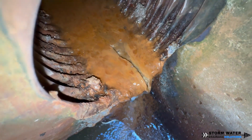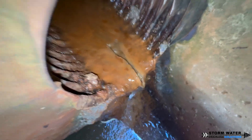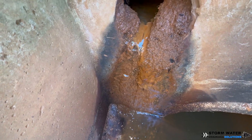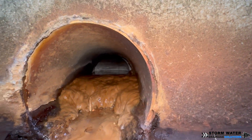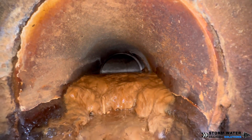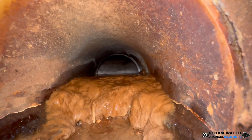So what exactly is iron ochre? Basically, iron ochre is a naturally occurring biological process. It's created when iron oxidizing bacteria that exists in the soil and in the groundwater consume soluble iron that is in the water. When this water is exposed to oxygen — when it enters a drainage system and there's more void for oxygen to travel through — the bacteria oxidize the iron into insoluble iron. What this does is it creates a slimy gelatinous jelly that typically is an orange-brown color, and it's essentially a waste product of the bacteria. It can also come in a gray color or a darker white color as well, depending on the location and the soil types.